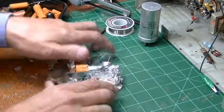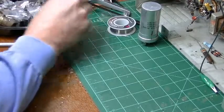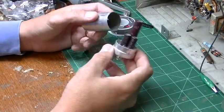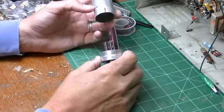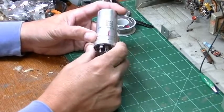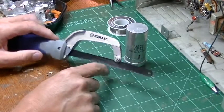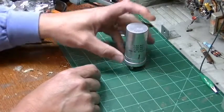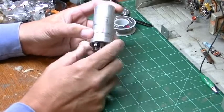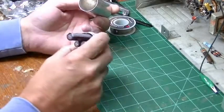The other thing — I know I said I wasn't going to do this, but I got to thinking that some of my subscribers may have never seen how I restuff an electrolytic can. I'll show you real quick how I do it. I start out by making a mark on the outside of the can, then I come in with a fine-bladed hacksaw and very carefully cut it open at that mark, so I know how the cap goes back on for best fit.